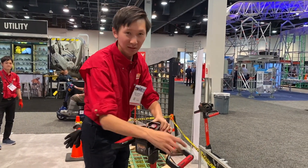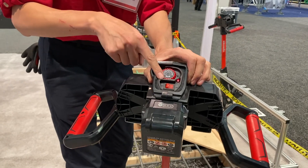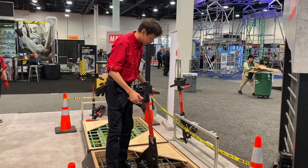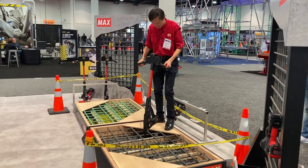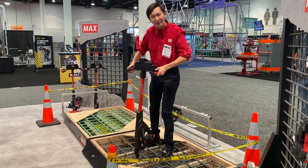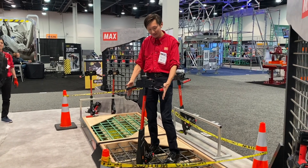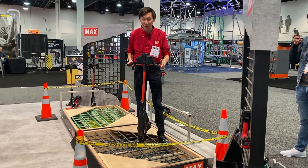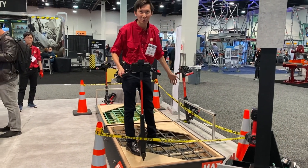Turn on the tool first — that button right here just turns on the tool. Now you put it inside the rebar, let it slide. You don't have any of this wrist motion that strains your back; all you've got to do is put it in and let it slide. If you want to do a cross-tie, tilt this way — ties right over it, no problem.